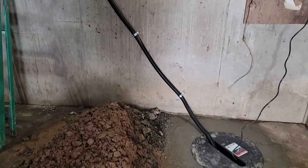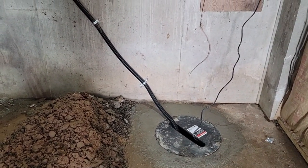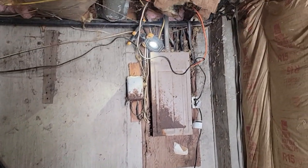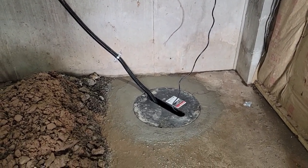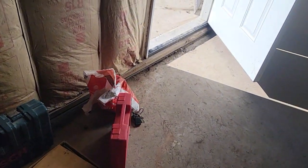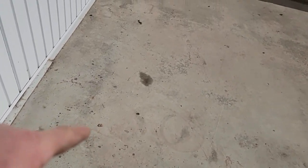But that looks pretty neat. And like I said, it's got the check valve. And that way it won't get airlocked. It goes up. I'll caulk around that. Everything's looking good. This finished off nice around here. The other thing I want to do is outside here, I'll use my bulldog and I'll drill some 1/4 inch holes, maybe larger 3/8 holes.